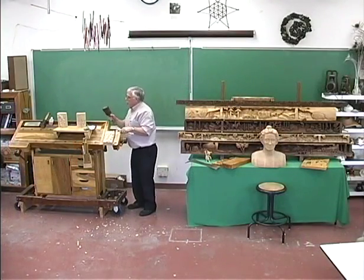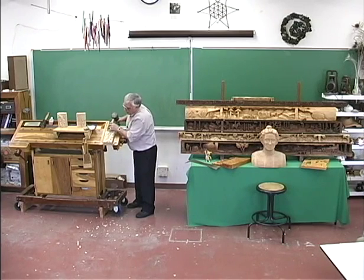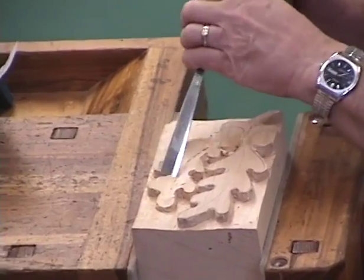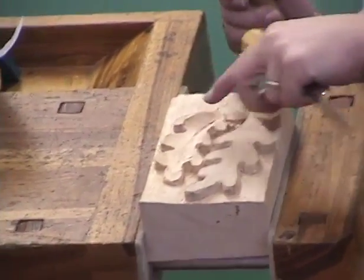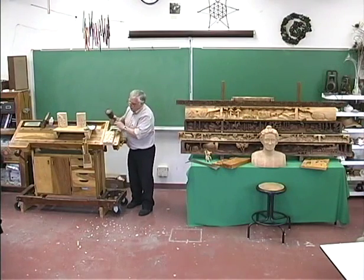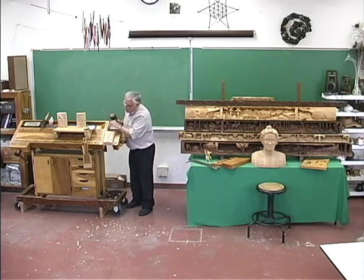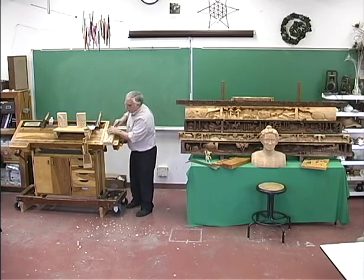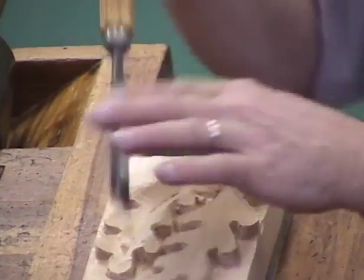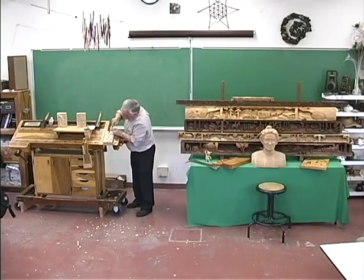We're in the process of contouring this carving. Every time I hit the tool with the mallet, it creates a line — you can see how many times I hit the chisel by how many lines there are. I call those pound lines. Every hit gives the chisel a slightly different angle, so it cuts in a slightly different direction. When you go to finish up, you take the chisel and push it by hand to smooth off that area, getting rid of the pound lines and taking the tool marks out — essentially planing the surface by hand.